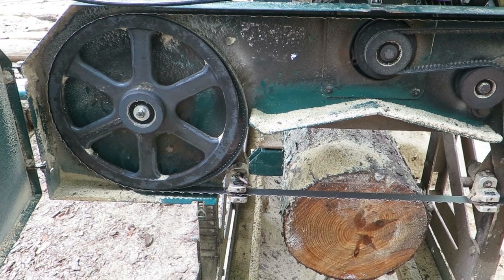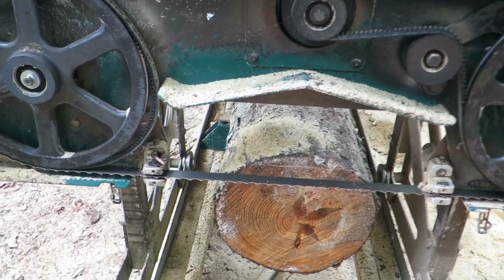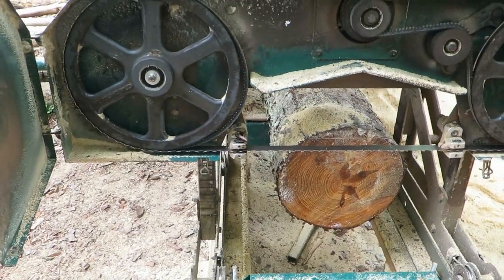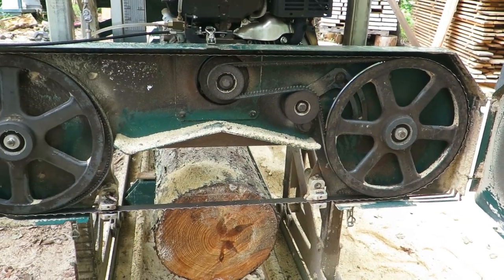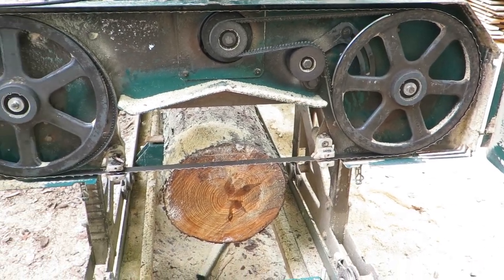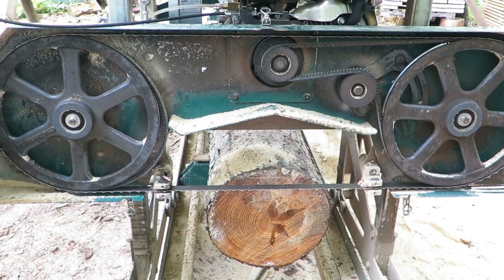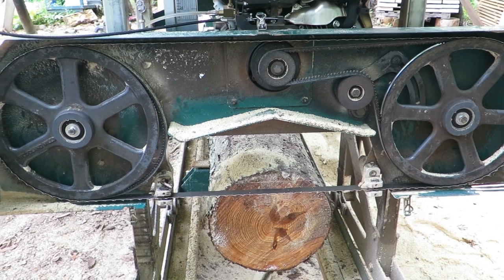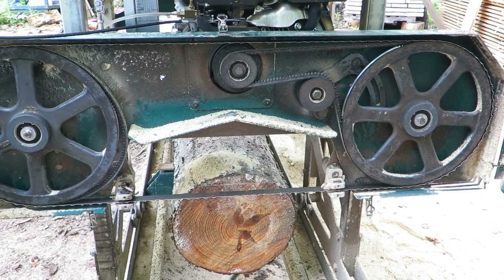I heard back from the company on that, and they are basically saying it's something with the saw. They said apparently we're putting friction or tension on the blade, but I've got them set with spacings. I run coolant, I run the lubricant. Anyway, they're insisting that I only run them for an hour and a half at a time. This does not make sense, because they're nowhere near dull at an hour unless you hit something. Most of the time I run it between 3 and 5 hours, depending on what kind of wood I'm cutting, before I change them. But that last one, it was between 4 and 5 before it broke.